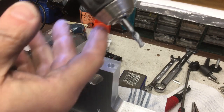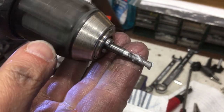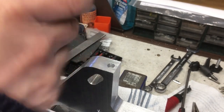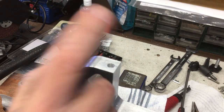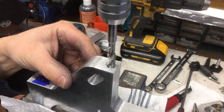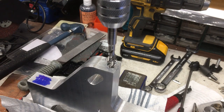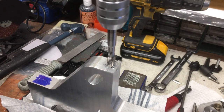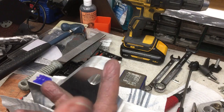That's got it. There was a tiny bit of drill left down at the bottom, so I just used an end mill. Started the hole out with a 6mm twist drill and then used the end mill just to... This is an old one. That sorted it. We're down to clean metal. Right, let's tap this. I'll just change that in CAD to M8 and no one will ever know.